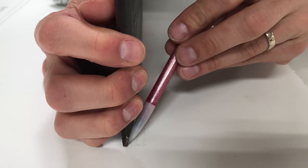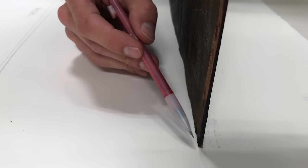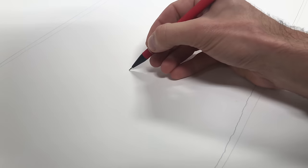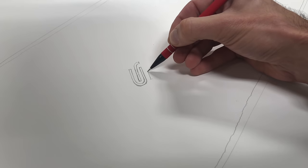You can see me flexing the panel into its natural bowed state. If the panel were dry at 8%, it probably would have cracked at this point. So I'm going to take a tracing of the panel in its bowed state and use that later on to create a jig.